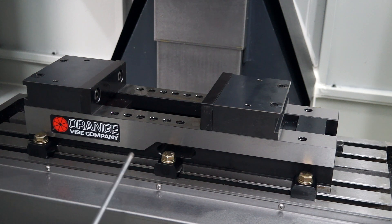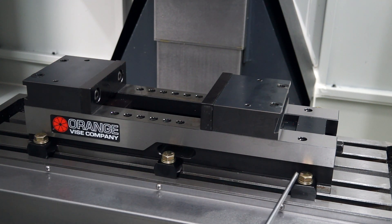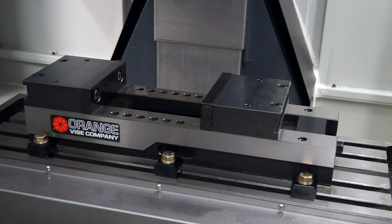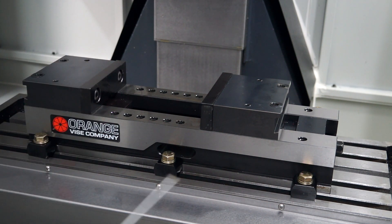I've put the three fittings on that come with the vise — the three little toe clamps. I've just nipped these up; they aren't tight at all, but this one here is tight. I've got two other clamps on the back side from my clamp set. This won't be permanent — I need to amend this later and make some different clamps to get this vise more centralized on the table.